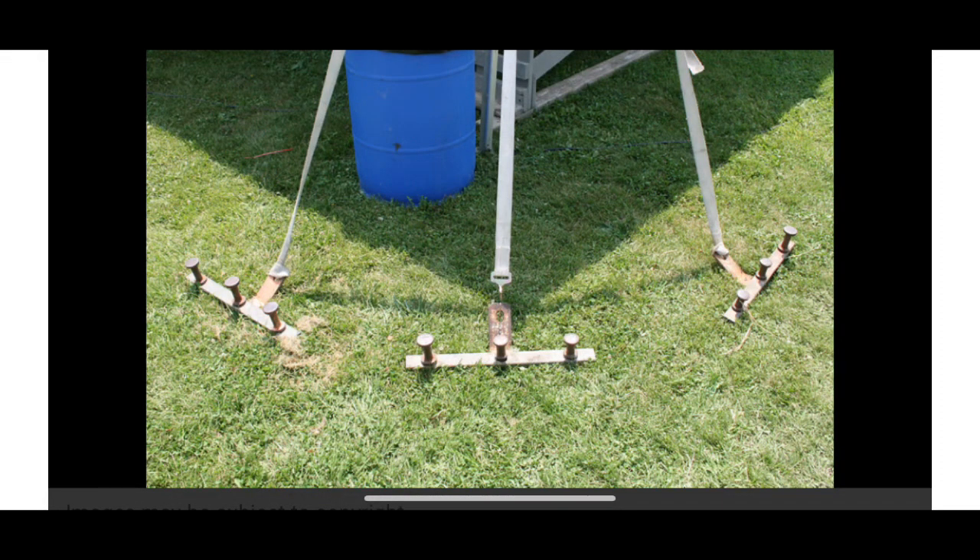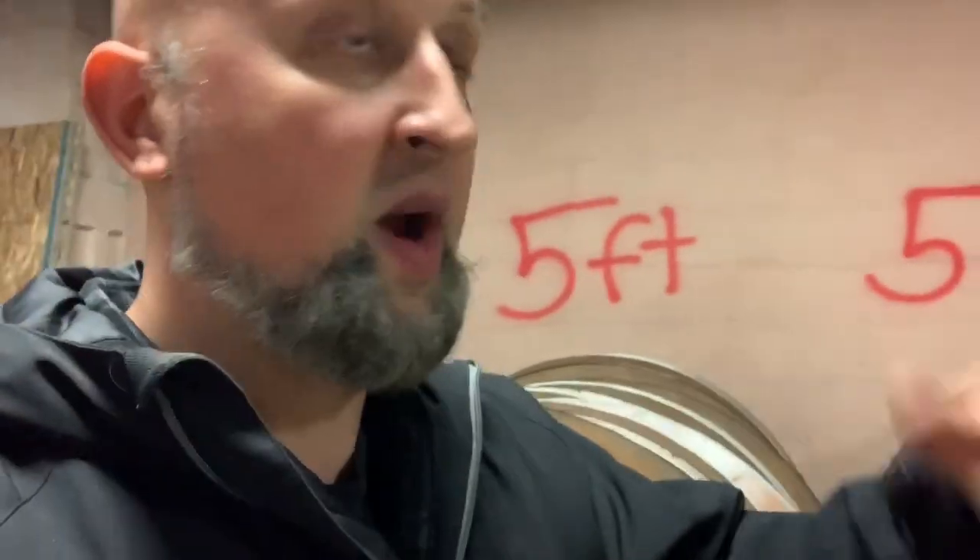I'm going to be doing a tent on a piece of property next summer when we buy the tent. I'm going to use stake bars on every single pole, and on the corners I'm going to use six stakes and even maybe do three ratchets like in this picture right here. There are many different styles — I've seen stake bars with two holes, which I don't really understand; three makes more sense. Then there are six-hole versions, and some that are square tubes and some that are flat pieces with holes in it. I like the square tubes better — I think they're stronger.